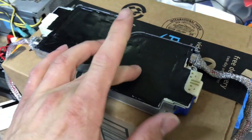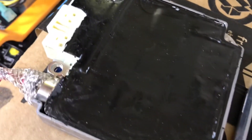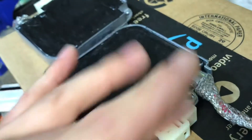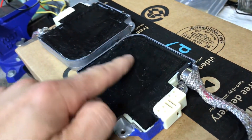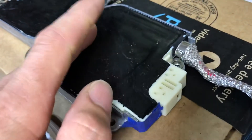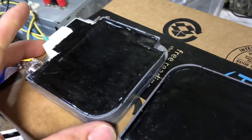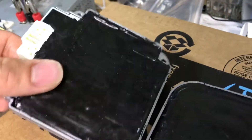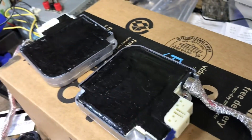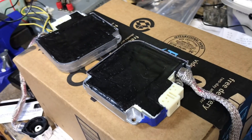I've let it cure for a couple of days and it's solid now. As you can tell, it molded and filled in all the contours and crevices. It's not perfectly smooth because when I was laying it out I used an ice cream stick to spread it, and those lines from the stick kind of bubbled up and gave it a little imperfection. But still not bad — it's sealed, potted, and waterproof now. You could just mount this straight to the car, outside of the headlight, wherever you want, and it should be waterproof and last a long time.